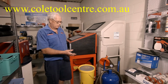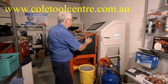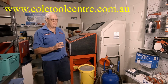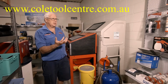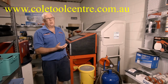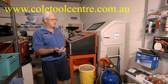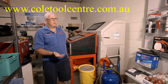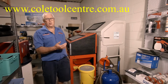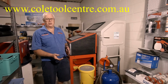Air consumption is a concern when you're doing sandblasting, because most of these bigger machines like this will use about 20 CFM of free air delivered at 100 psi. That means that while you've got your trigger down, that's how much it's using. So if you want to sandblast continuously, you need a 20 CFM compressor, which is like 7.5 horsepower 3-phase. Now, if you're just at home, you might only have a single phase compressor, maybe something like a T20. You can use a T20, but you're going to be continually waiting for the air to catch up because you're using more air than the compressor can replace.